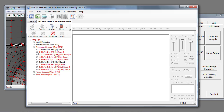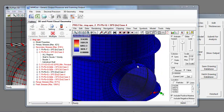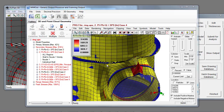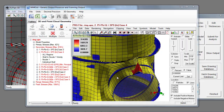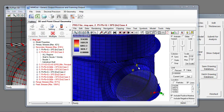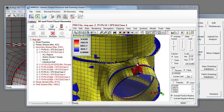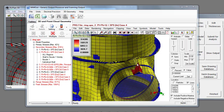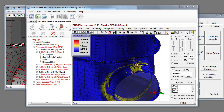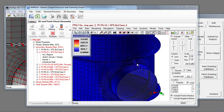We can go to the 3D and point cloud geometry tab and select the problem cases — in particular case 2 and case 4 — and view the stress plots. You can see we have some high stress areas between the gusset and the nozzle that are certainly areas for concern. In remediating this problem, we might want to consider applying some welded sections between the nozzle and the plate, because that gusset plate, while reinforcing the geometry, is causing a knife-edge effect on the nozzle, particularly in the primary plus secondary case.